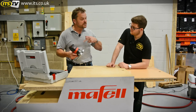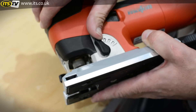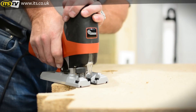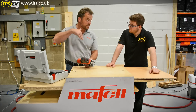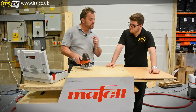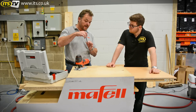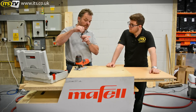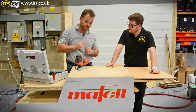The rear roller is what clears your waste — that pendulum action. You've still got a five-stage pendulum action depending on what material you're cutting. Rather than having a rear roller that fouls the blade, the whole plunger oscillates on an eccentric cam, which means it only kicks in when required. Even on full pendulum, if it's idling and not cutting, the blade will still just go straight up and down. Only when it feels pressure and starts to cut will that plunger kick in, and if you stop any pressure, it goes straight up and down. That's another patent.